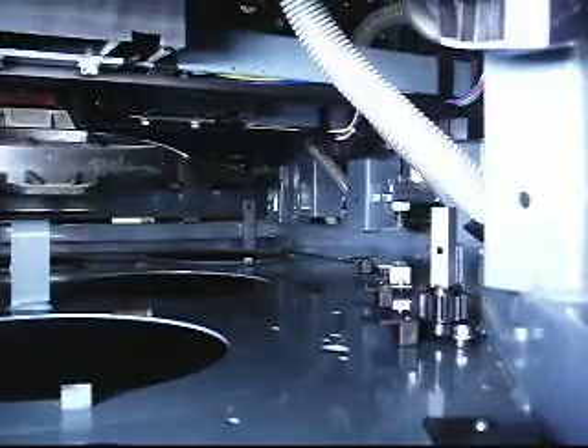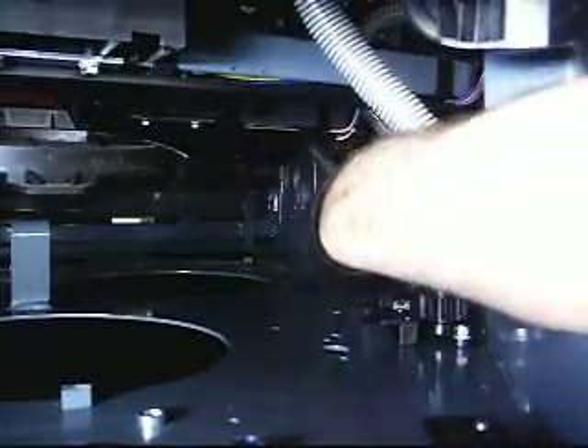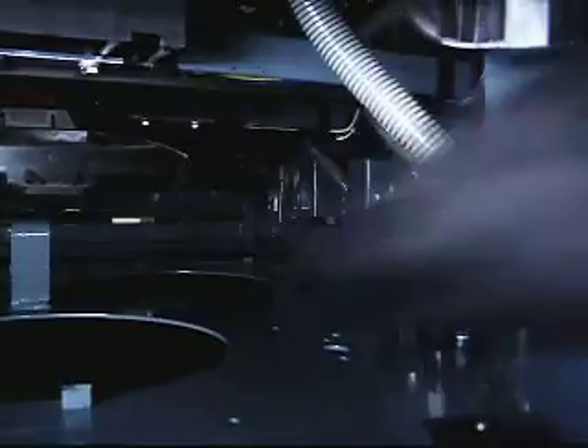Next I'm going to put on the smaller gear wheel. It works right in correlation with this square shaft drive to the upper switch cluster area. You're going to take the large bolt running into the bottom of the table next to the square shaft. Take your bushing — it has the recess on the top, make sure the top is up in the air — drop it on that same bolt. Put your star gear back on. Grab your smaller bushing, put the washer and the number 13 lock nut on. Tighten it up with number three Phillips from the bottom.